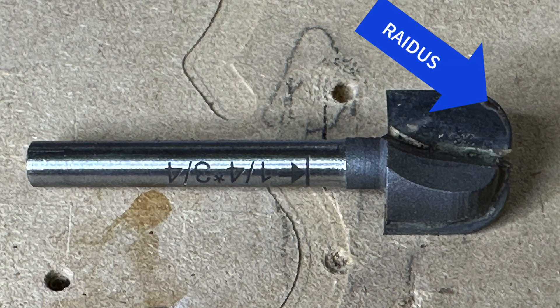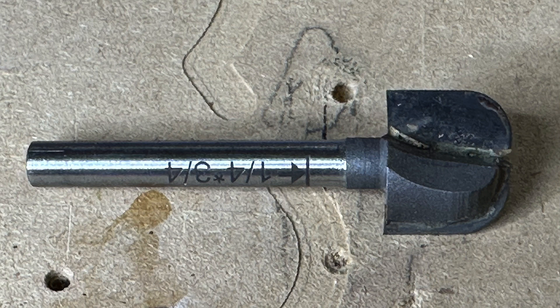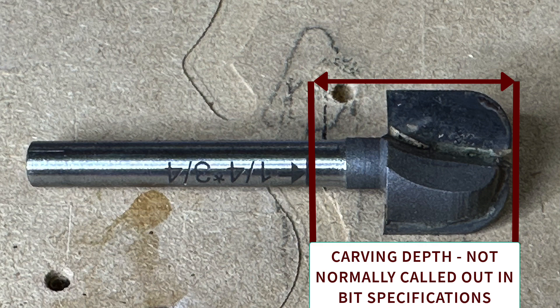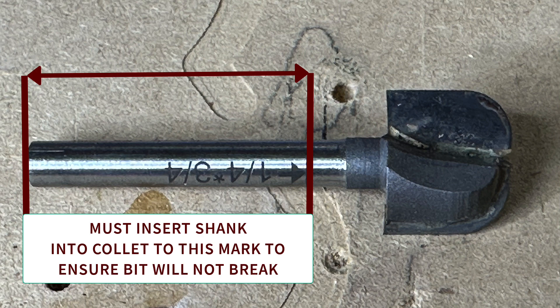The next element we're concerned about is the radius of the bit — that's the type of curve it's going to leave in the edge of the bowl. The next measurement you'll hear about in the specs is cutting depth, which is the depth of this head. Although that's called the cutting depth, that's not the actual depth by which you can carve a bowl. You can carve a bowl up to the line where you must insert the bit into the collet to make sure it's stable enough and won't snap on you. None of the bit manufacturers I've researched will actually provide this carving depth measurement — they provide the depth of cut, diameter, and radius, but not the carving depth.